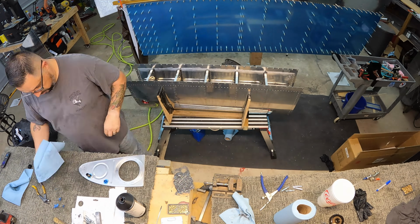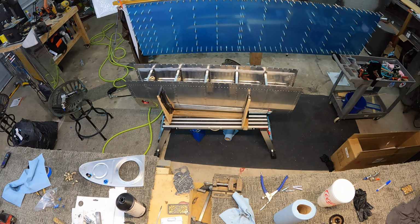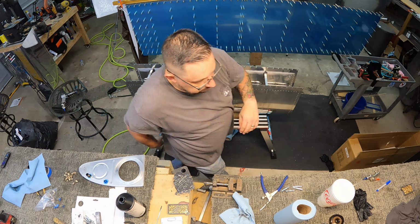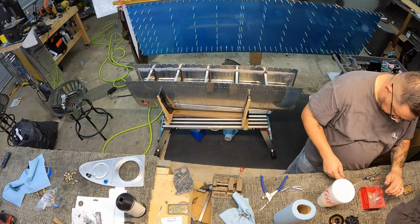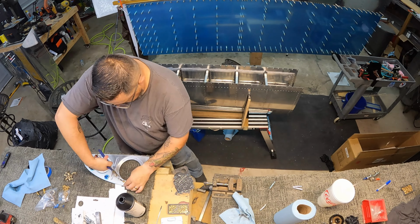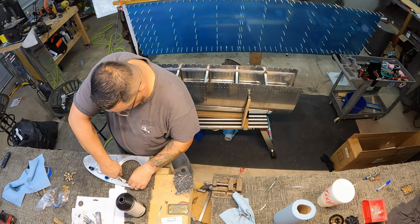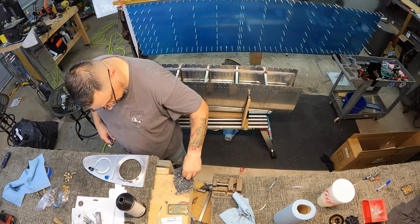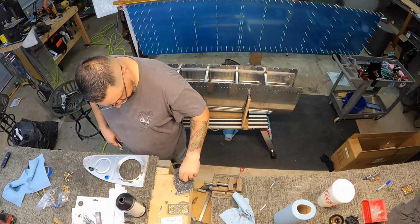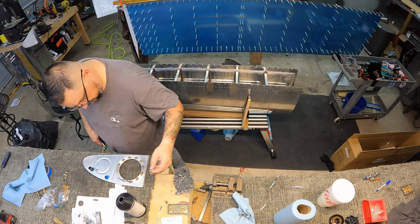So since I had a little bit of sealant left, I decided I would go ahead and install those nut plates for the access panel. And I think I mentioned in a previous video, through another online suggestion, I went ahead and bought the completely encapsulated nut plates that have like a little mini gasket on them as well. Since I'm not sure how well they're going to seal, I'm just putting a little dab of sealant on them anyhow, just to help hold them down.